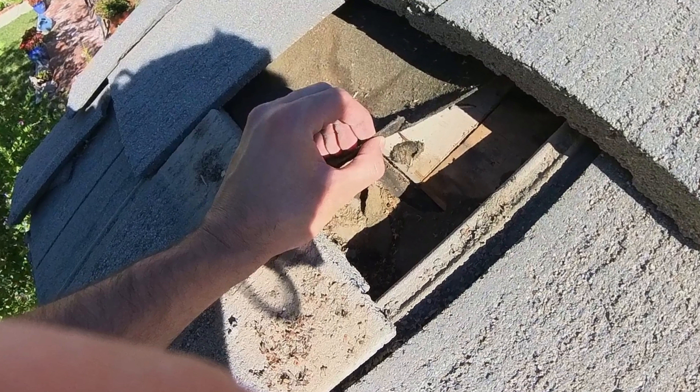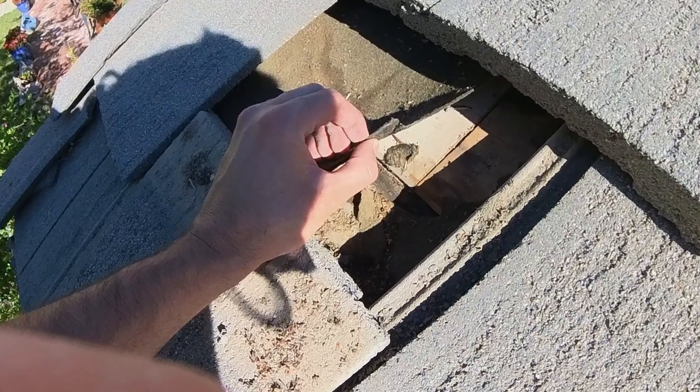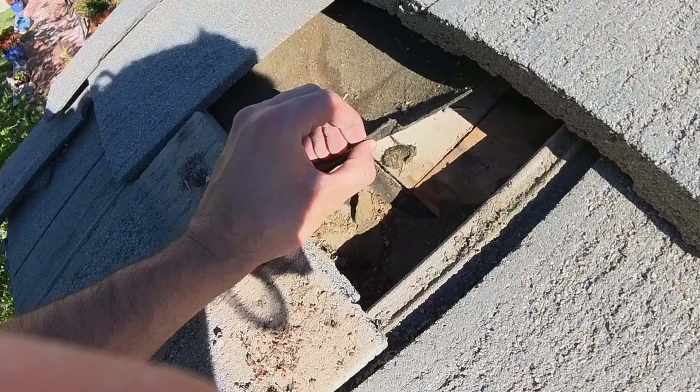That's why whenever we install a roof, we use a fiberglass-based underlayment — SBS modified, so it's more waterproof. When you look here, you see a number 30 paper-based underlayment. It's interesting because this area has the tile back in place but the underlayment's entirely gone. It might just be the age — 37 years is really beyond the expiration date. But we can see essentially the wood right underneath, and that's why underlayment is very important on tile roofs.